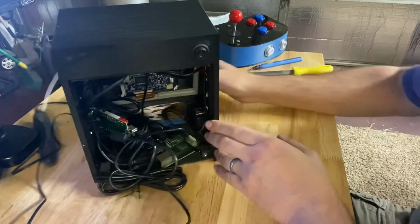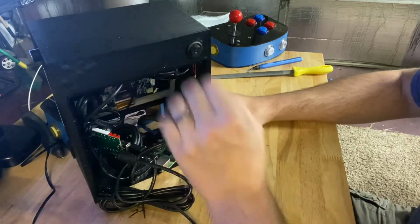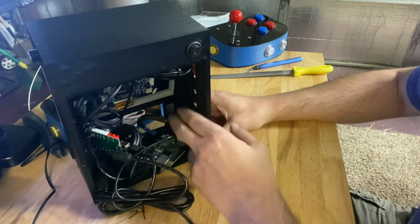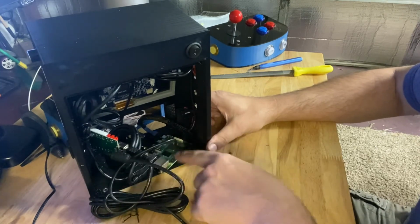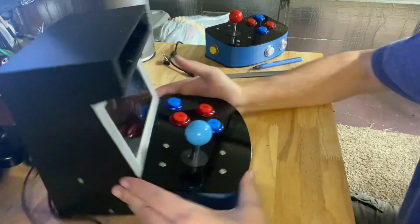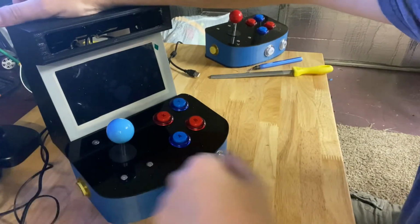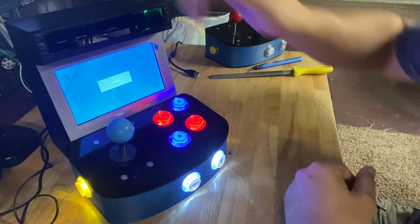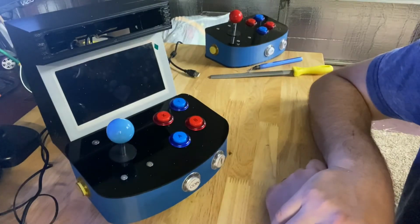So what I actually did, I had already soldered in the switch to my Pi. I actually was able to then parallel my screen, cut off the USB end, and then solder it in parallel to the USB Type-C connector for my Pi. So when I power the Pi, simultaneously I should power the screen as well. There you go. Okay. It works, at least for now.